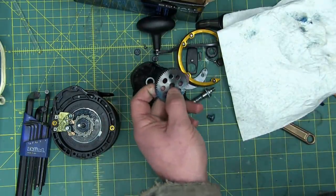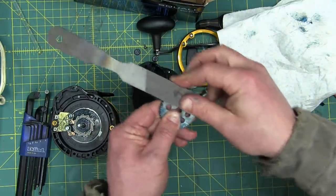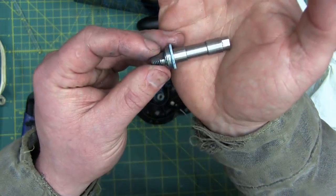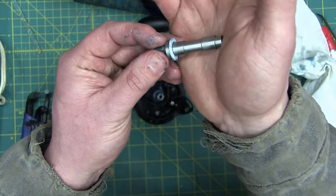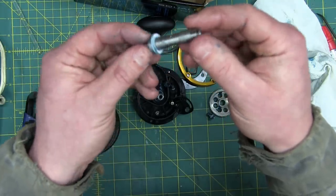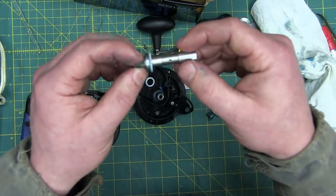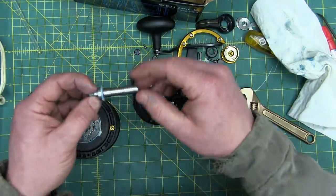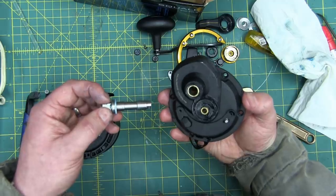Let's have a wee look here. Soft — not hardened. And there's the input shaft. Very cheap part, not ground — it's just been turned on the lathe and then vibratory finished, even on that bearing surface. So quite crappily made there. You'd expect to see a ground finish and a proper oil-lite bushing. Although, considering you're doing it by hand, there is quite a bit of meat there.